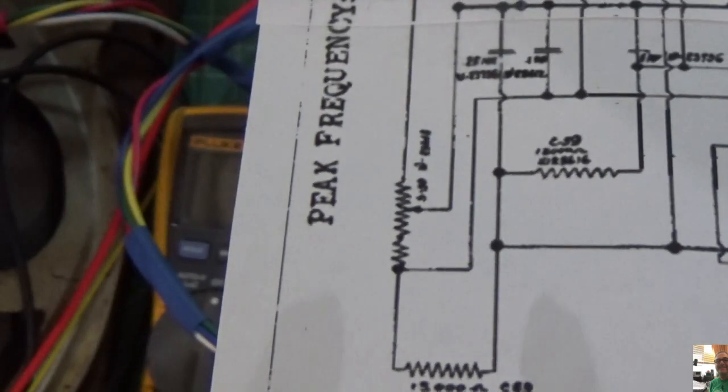Well, it turns out, from what I can tell from my research, that this radio had a different volume pot originally. And that volume pot had a dropping resistor attached to it. And going back to a model 59, the value of that resistor right there is about 200 ohms. So what I did is I put a 200 ohm resistor right here, coming off of the leg of the volume pot, right before this 15K, and my voltages are perfect. Everything is where it needs to be. So, if you ever see a symbol like that, you'll know what it means. It means there's something else there.